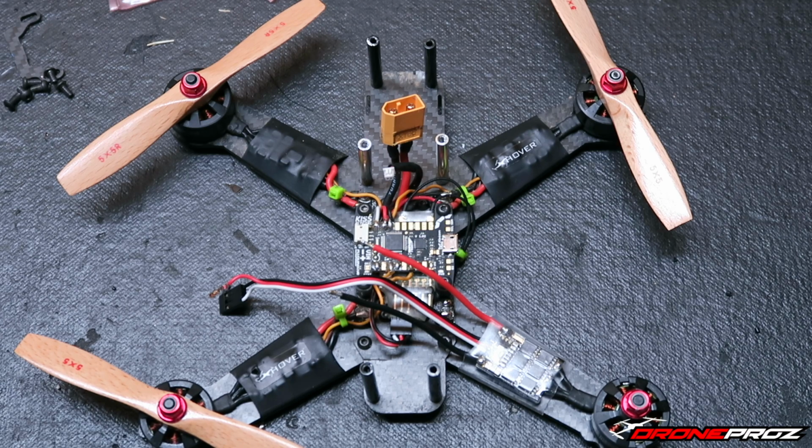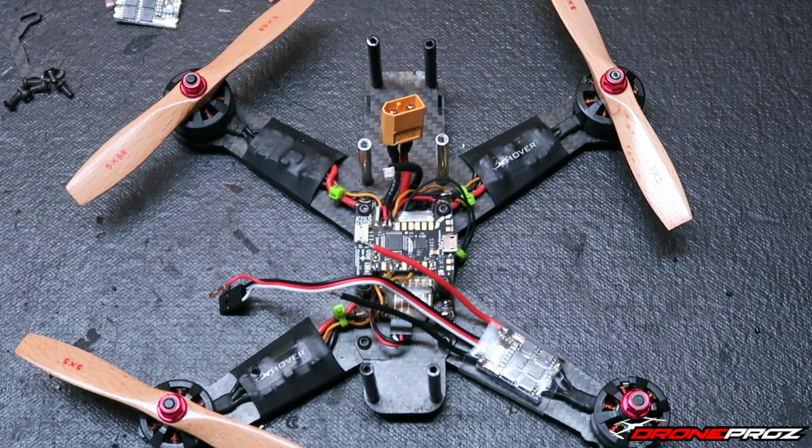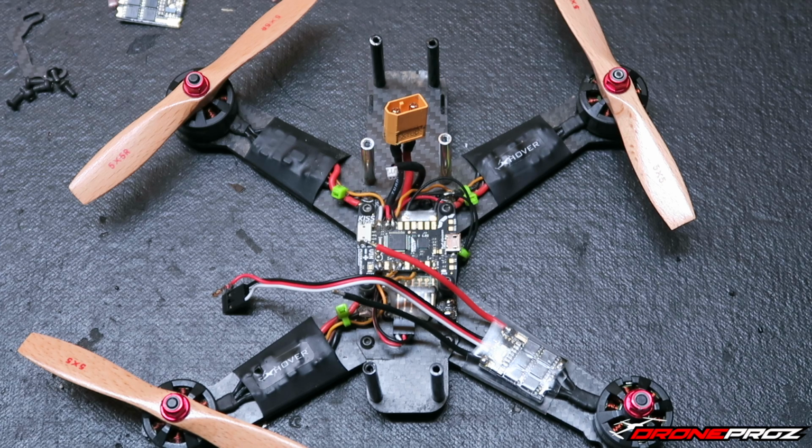It's blazing fast. Now, a lot of the things I've seen with racers evolving as far as the ESC software side is the whole damped light. I don't know how many of you guys out there actually pay attention to what damped light really does to your motor. It actually makes it run really rough. It's very abrupt and very hard on it. Especially for you guys coming from RC planes or helicopters, we're so used to the ESCs in that industry being so smooth and working so seamlessly with the motor. When you get into these racers, the ESCs, especially the BLHeli stuff with damped light, it's very aggressive on the motors. It's not the smoothest, but it gets the job done, and it does it very well. It's kind of something we got used to. I accepted it. I was like, it is what it is. That's what it's going to be.